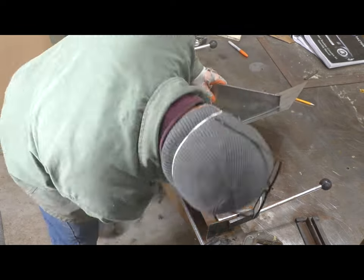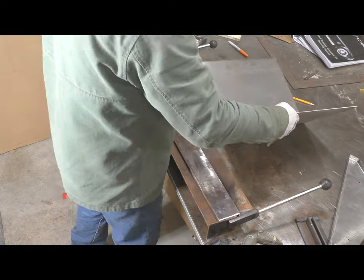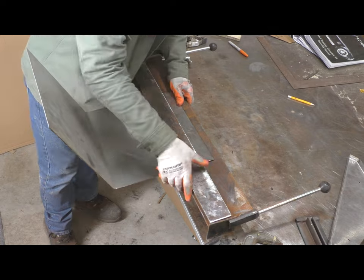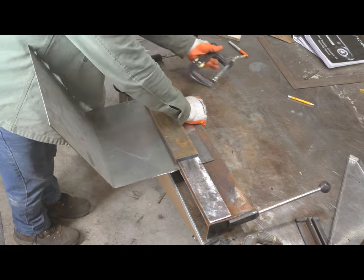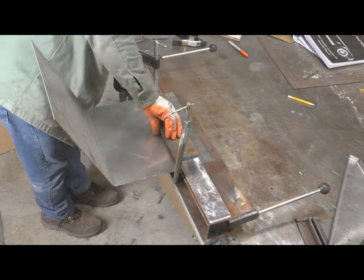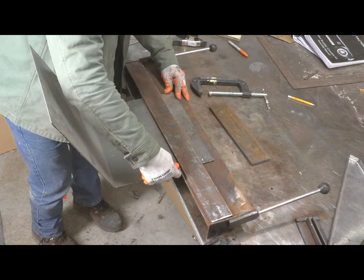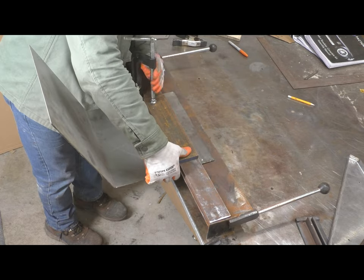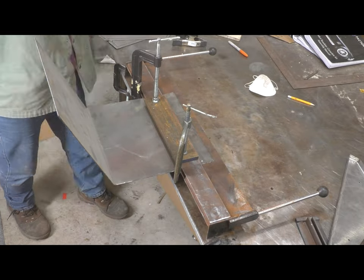What I'm bending here is the top shell, or basically the top half of the muffler. This is all out of 16 gauge stainless steel, which doesn't like to bend, especially when I'm using this small handbrake. It's just a Harbor Freight 30-inch unit, I think, but it works great. I definitely stressed it in this situation. In some cases, you'll see me pre-score some of the steel, and that helps make the bends a little crisper, but definitely 16 gauge is the limit here.